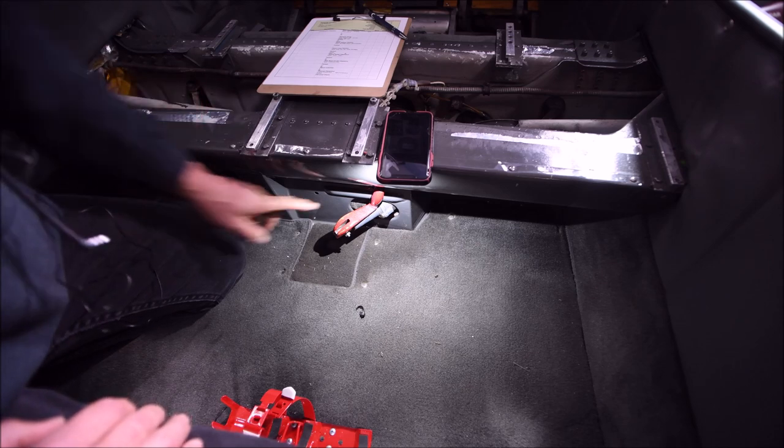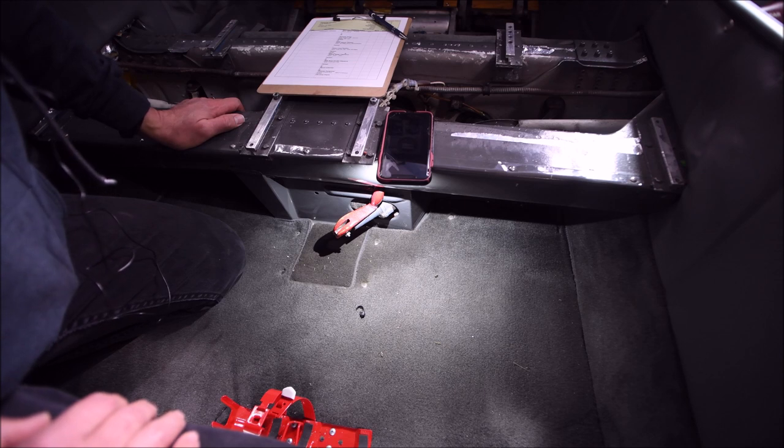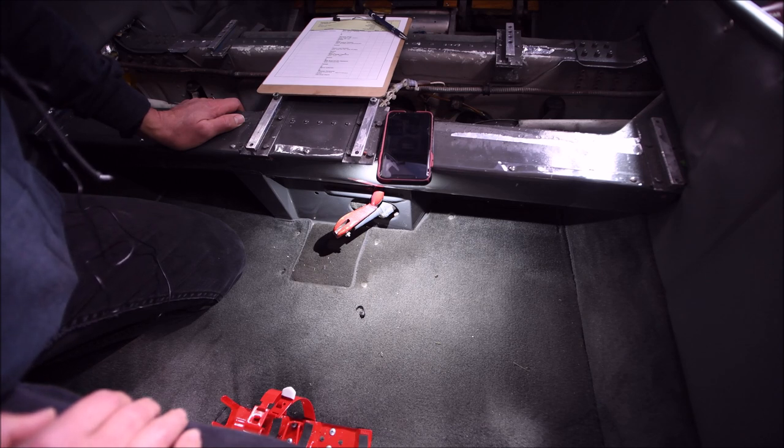The way we do that is with the emergency hand crank. On this airplane, this is a 12-volt system. It has a green painted gearbox — later 24-volt systems are supposed to have a white painted gearbox. Color can be a little misleading; if the gearbox has been out and overhauled, sometimes people will paint it the wrong color. So I look for 12 or 24-volt markings: generally the 12-volt is going to be 1/8 to 1/4 turn, and the 24-volt will be 5/8 to 3/4 turn.